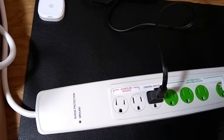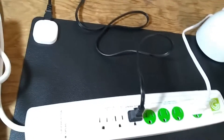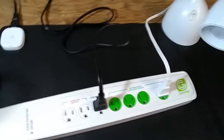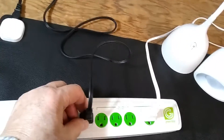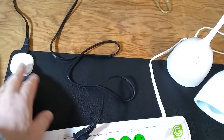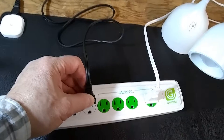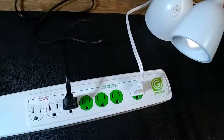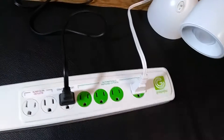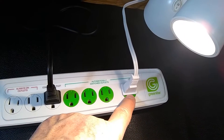To see what's happening with the relay, I'm plugging in a light to show the switched outlet status. With no load — just the switch mode power supply of the mat plugged in but off — there should be no activity on the relay, but I get a few clicks right away. It does not work perfectly with switch mode power supplies. Turning it on to the highest setting, now it works fine and the light is on.